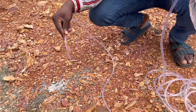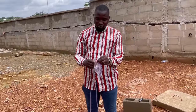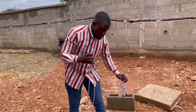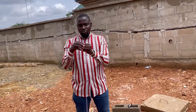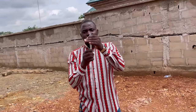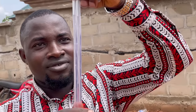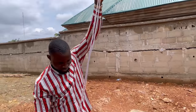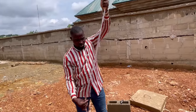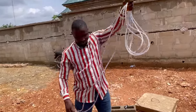as you can see in the video. While the water is being flushed, care should be taken. The tube should be properly observed to make sure that there are no air bubbles left in the tube. After filling the tube, both ends of the tube are drawn together, closely placed at the same level and observed to make sure that the meniscus is all at the same level. Once they are at the same level, it means that there is no air bubble.